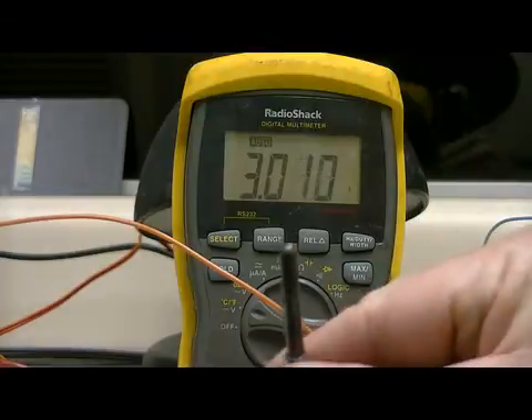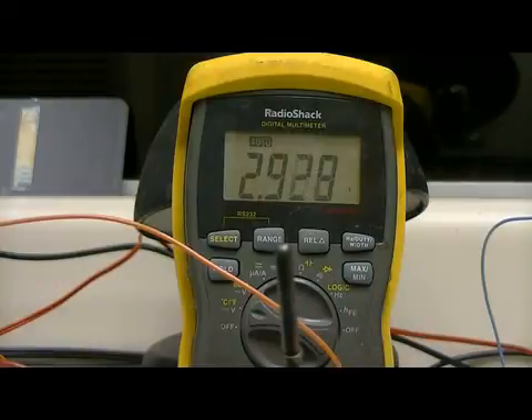Even now it's still quite hot to touch, but it will drop down to probably half a volt when it's completely cool. So that's what the thermocouple amplifier does — it goes from about 20 millivolts all the way up to 10 volts if I wanted, depending on how I adjust the control. I hope this might be of use to somebody, and I thank the visitor who alerted me to the problem with the old design. The new design has been posted — thanks for listening.